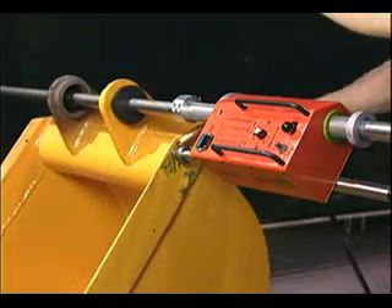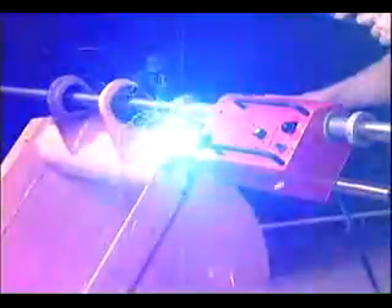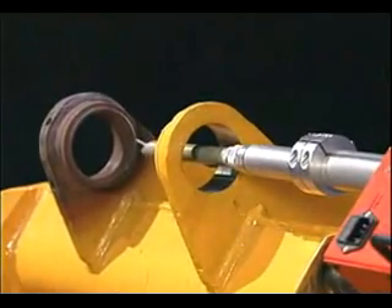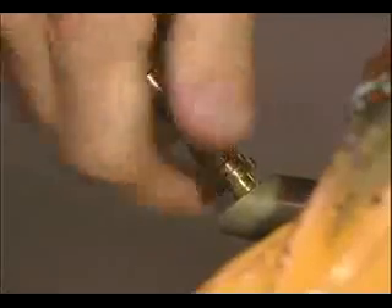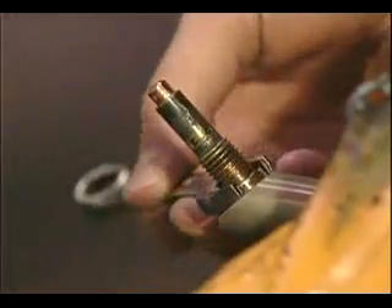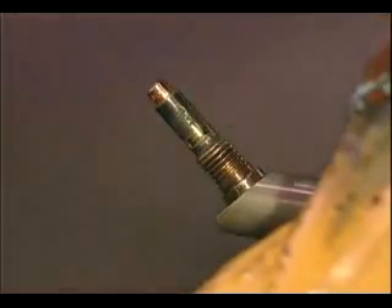Once centered using a boring bar or inch-and-a-quarter pipe, the tack nut may be welded into place. The torch and wire feed conduit are then put in place. With the welding wire fed through to the torch, the nozzle and tip are assembled and the system is ready for final adjustments.